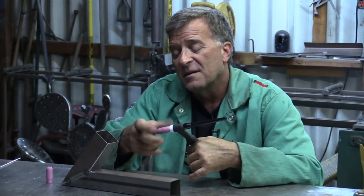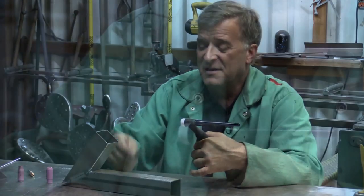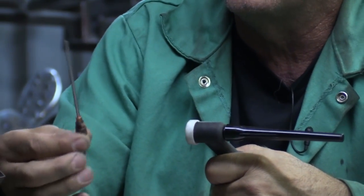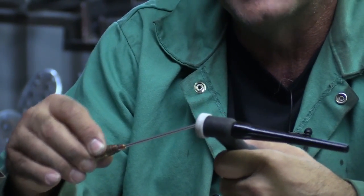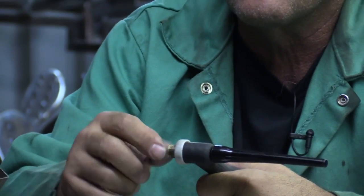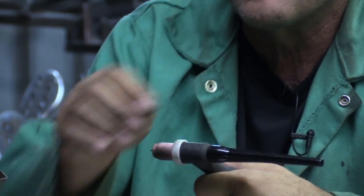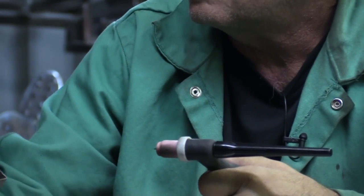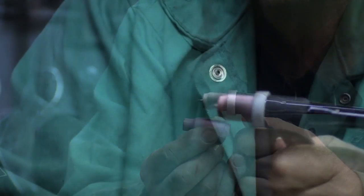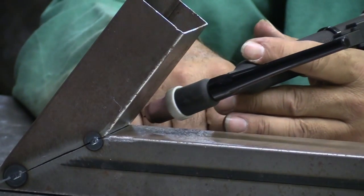A better way than this, even, is to go ahead and get the big long cup off of there. We'll get the collet and the tungsten out of it, and we'll pop this little ring off and put the flat one on there. Then we'll go ahead and put this little stubby gas lens in there. That just helps make things a little bit smaller still, and with the gas lens on here, that helps shrink things up even further. It just gives you a little better angle to work with — helps shrink things up to get down inside that joint.